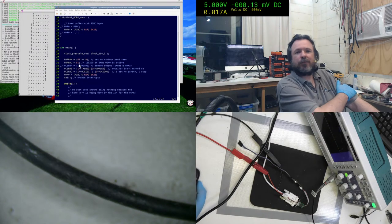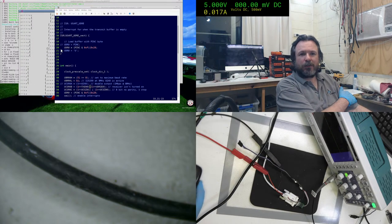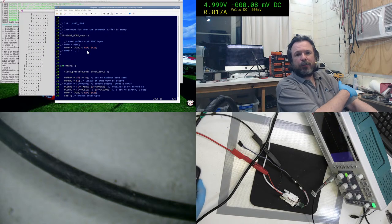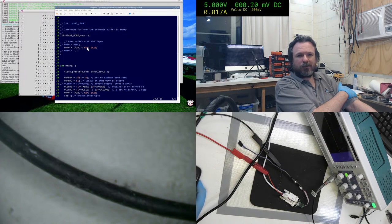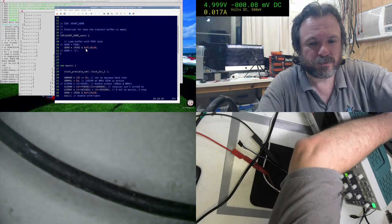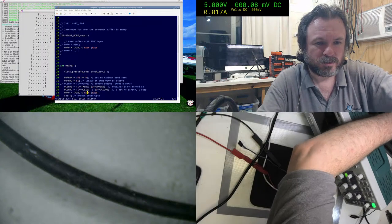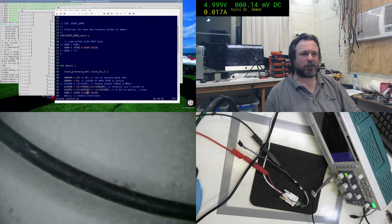So as far as I know, up here in this interrupt, as soon as I load UDR0 with a byte, which pin C, what am I doing here? That should be 0F, not, yeah, that should be 0F, because I want the lower nibble. Still doesn't explain that pattern though.